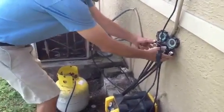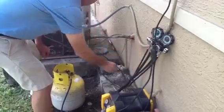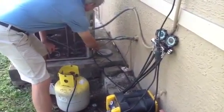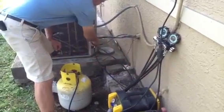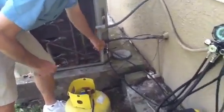So what we're going to do, we're going to go through our gauges here. We're going to take the suction line and hook it up — this is the blue one. This is the liquid line, we're going to hook it up — this is the red one. And these are actually industry standard: you always have blue for low and red for high.